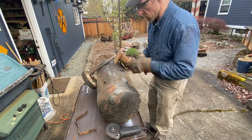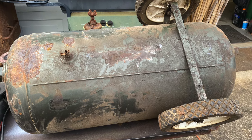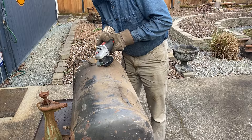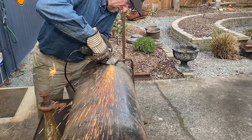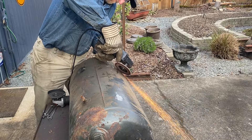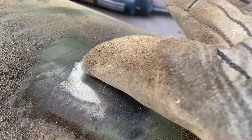I'm going to take a flapper wheel and smooth those out. I gently ground down with the flapper wheel until the bump was gone and then feathered the edges on all of the areas where there were brackets. That one looks like it dug into the metal a little bit so I'm just going to leave it — I don't need to have this thing perfect.